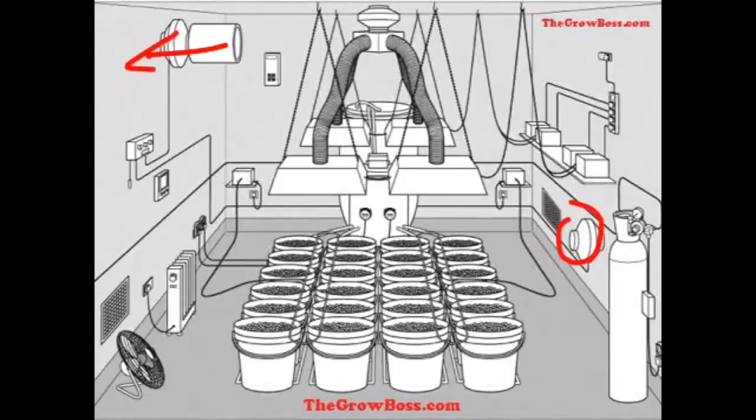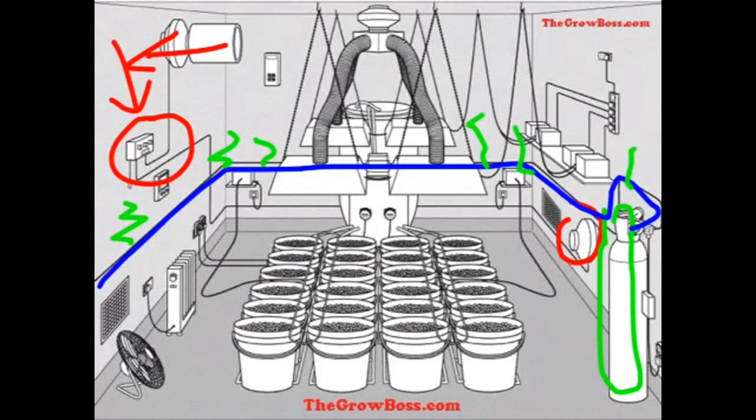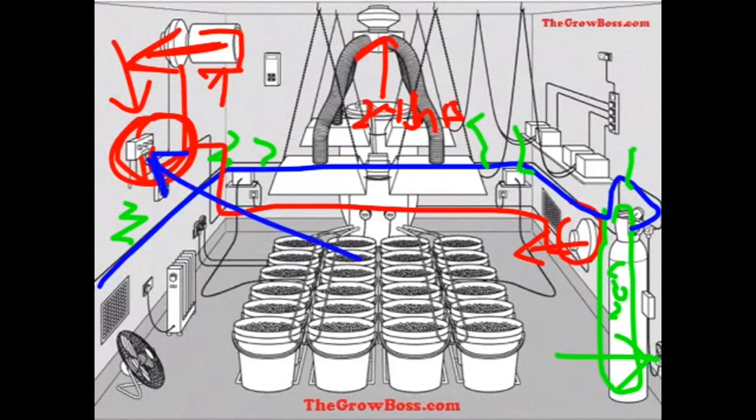Let's talk venting now, and let's talk about this controller and what it does, and the relationship to this CO2 tank in the room. The CO2 tank also — this is the wire that delivers the CO2 to the room. This is the timer that controls the CO2, and this is the timer that controls the exhaust in the room. I suspect that this is an intake and that this is the exhaust, because that's a carbon filter that takes the scent molecule out. This one here is on 24 hours. The important thing to notice is that this CO2 monitor and this CO2 timer don't talk to each other — they're independent.